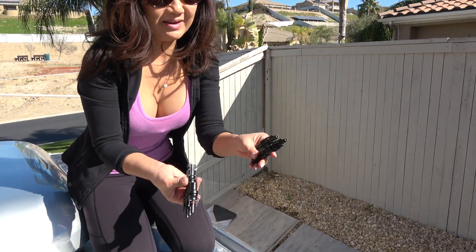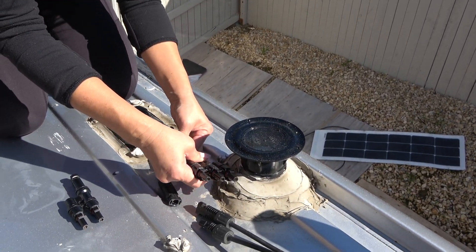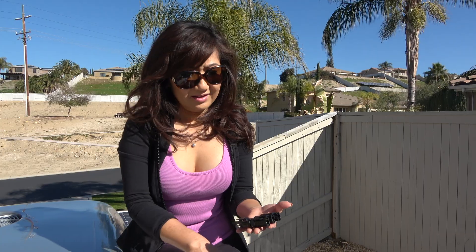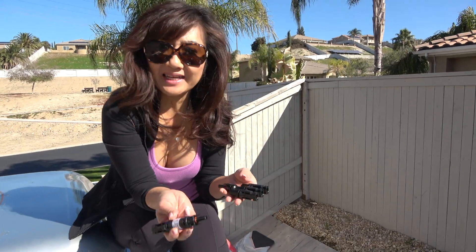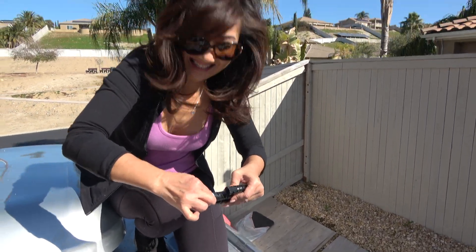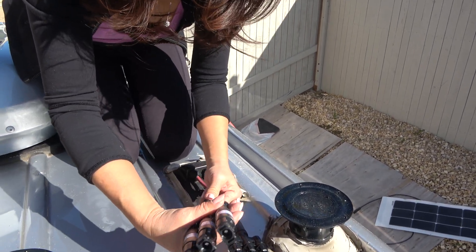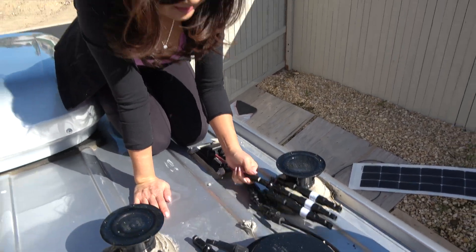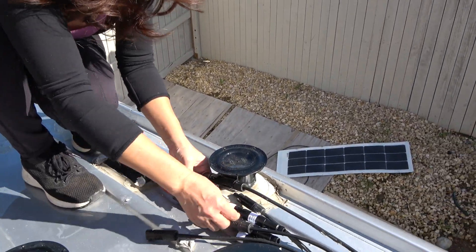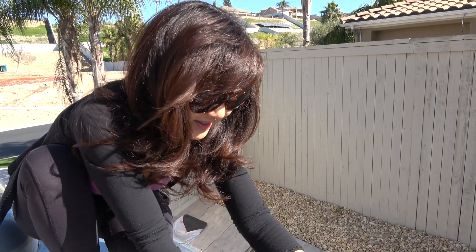Since we have three panels now, we have to switch from a one-to-two connector to a one-to-three on the negative side. For the positive side we need to put in an inline fuse — just snap it in. This is easy, easier than taking it out! Then we just snap it in here and connect the existing panel back into the new connector. We're going to take a break, eat lunch, and wait for the new sealant to set. When we come back from lunch we'll put the new panel on.